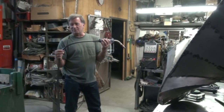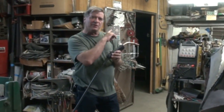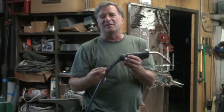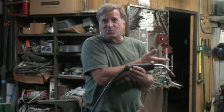So inside this heavy cable, this rubber liner here, there's actually a little Teflon tube down inside there that the wire runs through from the machine all the way up into the gun and then up the end. What happens is, especially if it gets in this position a lot, is that little Teflon liner gets a little V cut in it after, oh, 80 or 90 pounds worth of wire that's been through this machine.